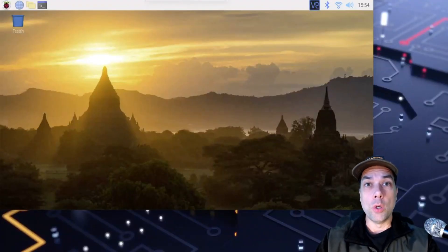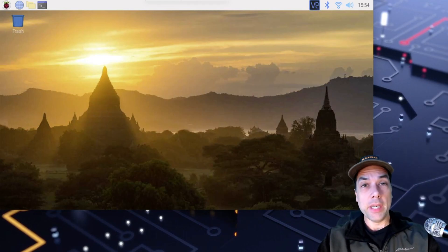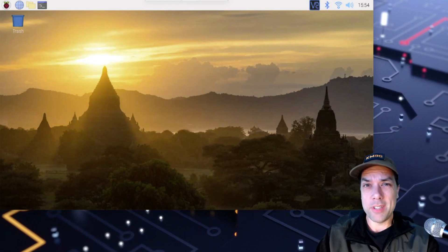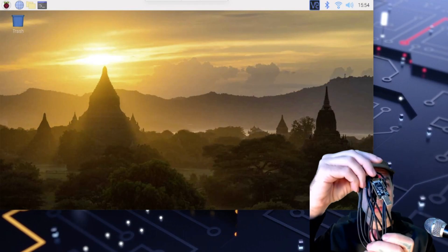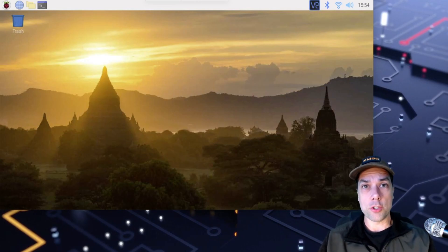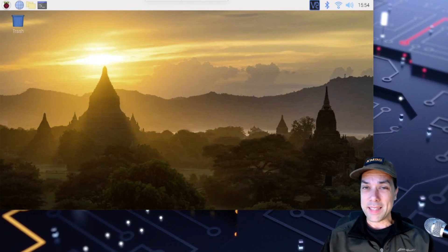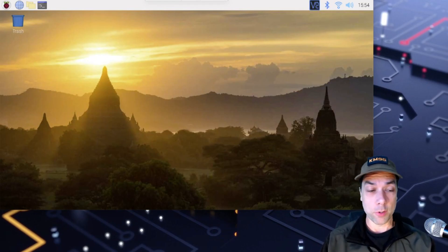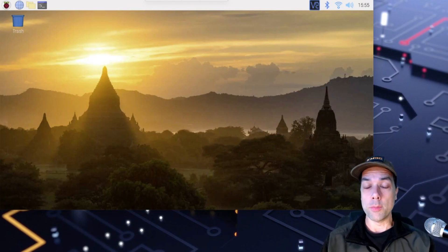So what you're going to need is a Baofeng. Well, you don't really need a Baofeng, but for $25, why don't you have 10 of them? You're also going to need a programming cable. This is one that I made, and I've got some instructions linked down below and in a card up above on how to make that cable — it's really straightforward. You put some wires together and connect it to the FT-232 board, which converts your USB port to a serial port.